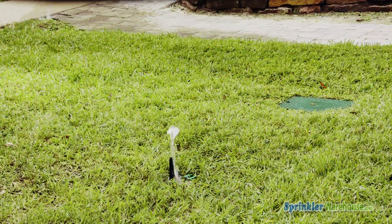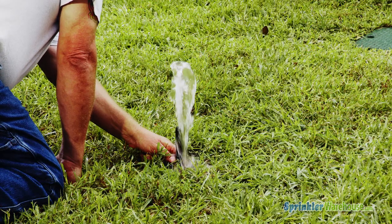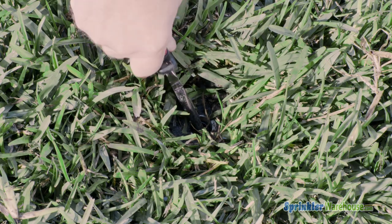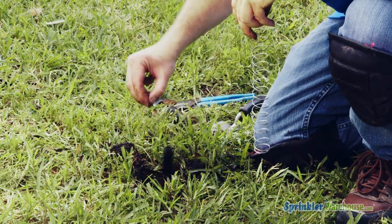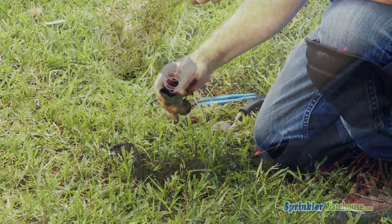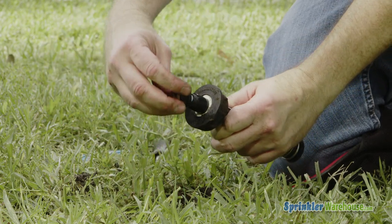It's a good idea to flush the head and see if the head still works otherwise. If you don't have a pull-up tool, this is where you need your assistant to hold the stem while you flush the system. If the stem slips back down into the head, pulling up the stem can be a bit of a pain without a pull-up tool. You'll probably have to remove the head, unscrew the top, reinsert the filter and nozzle, replace the head, and then re-flush — so try to avoid that.